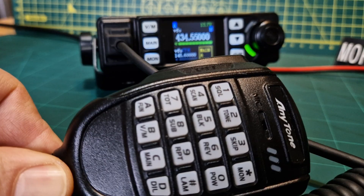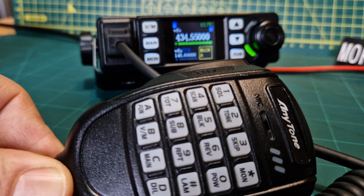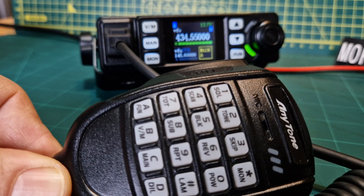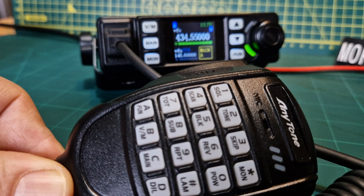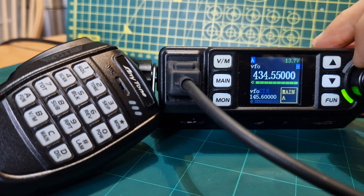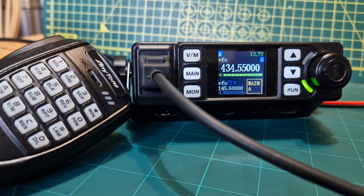Even programming a memory uses the microphone — you use A then star to go into the menu. To store a channel in standby: press the microphone A key, the top left corner will display 'Function', then press the up key — the bottom left corner will display 'Save'. Press up/down key to select a number, then hold the star key to store the new frequency and return to standby. The microphone isn't working on this radio at the moment so we're just using the front panel, but it sounds great. Thanks for watching — 73, all the best.